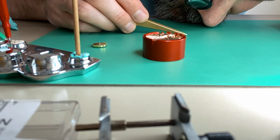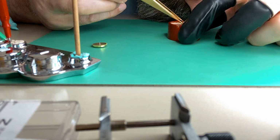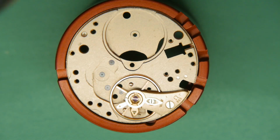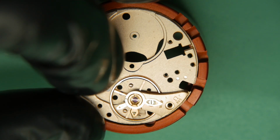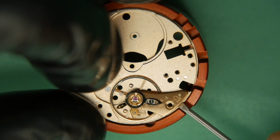I've had that before on watches that I've serviced where the balance has not been running correctly, and then I've realized, let me check something here, and whoever's done it before has mixed up the capstones between the top and the bottom, and it won't work. With watchmaking, there's really just one way to do it, in regards to where things live. And if anything feels like it needs to be forced, then it's 100% wrong.